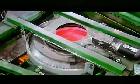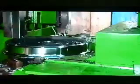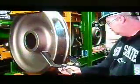After heat treatment, a machine sprays the outside of the wheel with cold water, which hardens the steel. Next, they machine the rim of the wheel and the axle hole. A worker then ensures they meet all specifications.